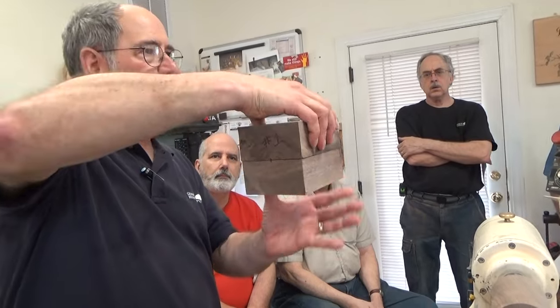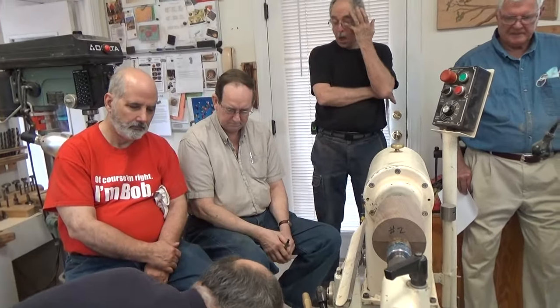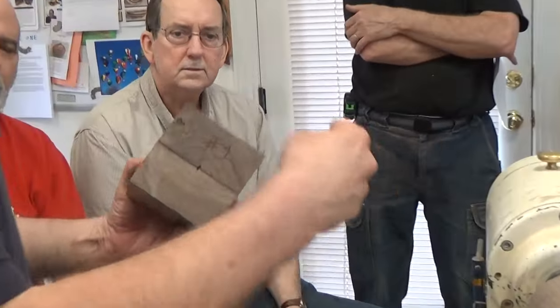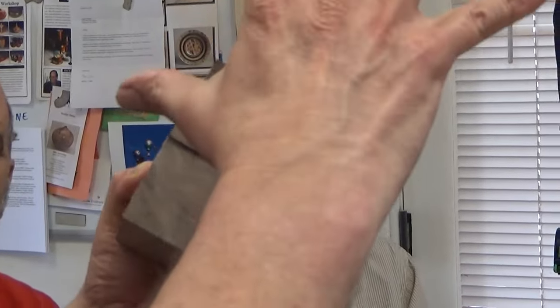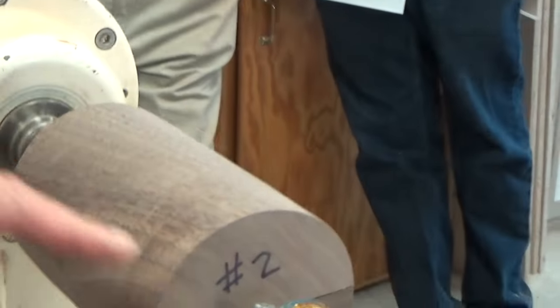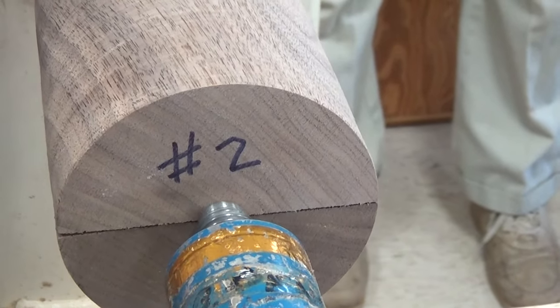No paper between the blocks. He discusses some other alternatives, but strongly recommends this one. When you have the two blocks, before you glue them together, it's imperative that you cut little Vs in the center. I use just a triangular or pyramidal file, and then just mark the center and draw it. We don't want to force a point into the center and break the glue joint — we want all the compression to be on the sides. I took the cone off the live end so I'd be pressing together and not splitting apart, and the Vs help make sure that happens.